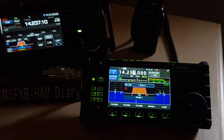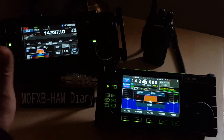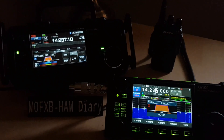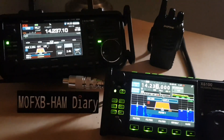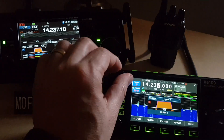I'd say you need at least 5 amps at 13.8V to get full 10 watts out of this radio. There are budget tuners available — I've got the ATU-40 coming, which I'll be testing soon, a £70 tuner for the 705. It's hard to compare them — they're both great fun.